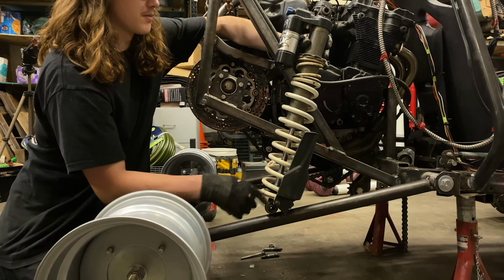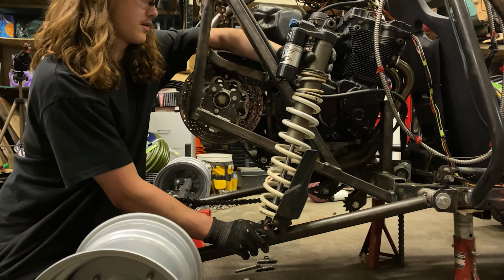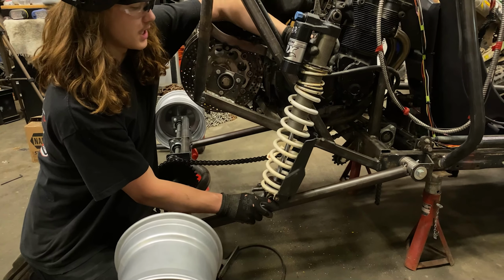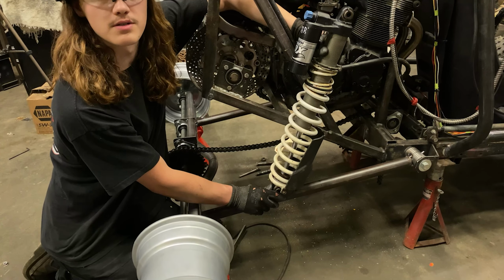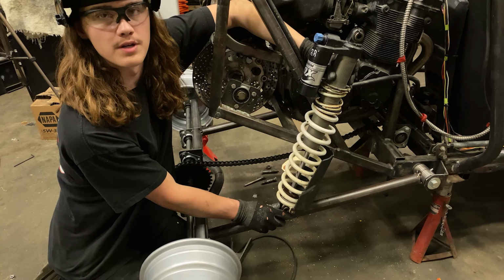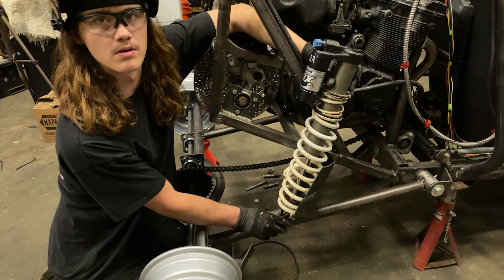So we got the lower portion of the swing arm done. Well, the first arm, there's going to be more, but we got to move on and start getting the spring mounts kind of made, so then we can know where the upper tube can go. We're hoping to be able to get roughly 6 inches of travel up, and then probably another 2 or 3, maybe 4 down. It just kind of depends on where we get the spring to mount.